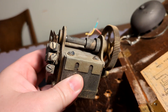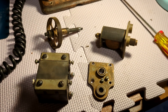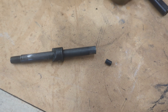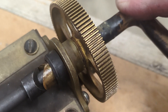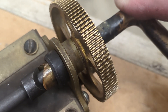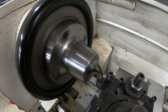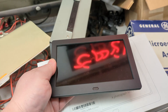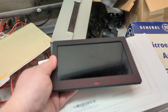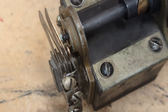As usual, reality ended up being a bit more complicated than that. The handset phone was pretty much ready to go, but its generator was very stiff. So I took it apart, cleaned everything up, and lubricated it, at which point it was working fine again. Unfortunately in the process, this little non-conductive nub broke off. This gets pushed out as you start to turn the crank, switching the line so that your local ringer is no longer connected. Without it, you'd be ringing your own ringer, which would be loud and annoying, and a waste of hand-cranked power. To replace the nub, I turned down a section of the useless plastic stands that came with some digital photo frames, and with a bit of shaping it fit nicely into the end of the shaft, and can hopefully provide another century of service for this phone.